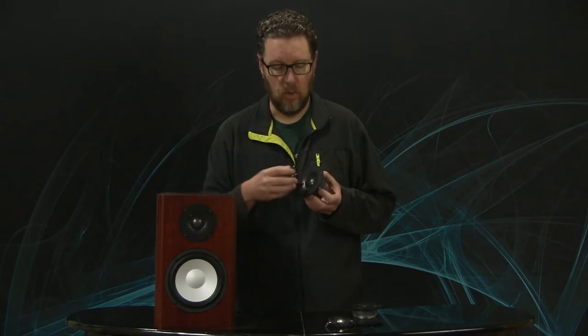But the fundamental issue is that the resonance tends to be very high, a very sharp resonance, very concentrated, usually in a small band, but outside of the audible range. People will happily look at raw tweeter measurements with no compensating waveguide or phase plug, and they'll see a spike in the response at 24,000 hertz or something, and declare, well, that resonance is why metal dome tweeters sound metallic and harsh.